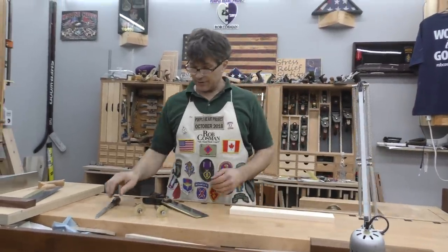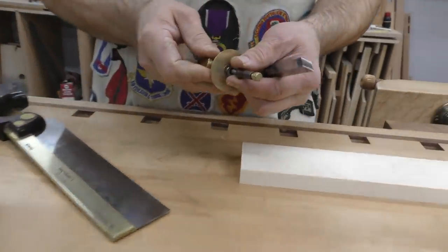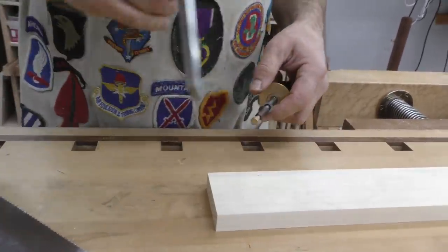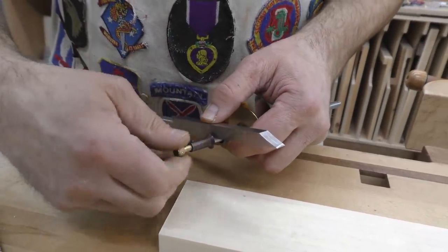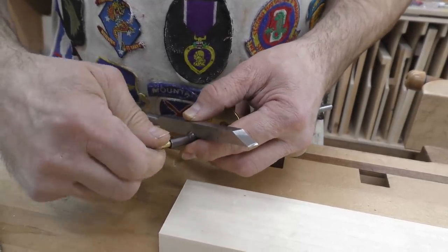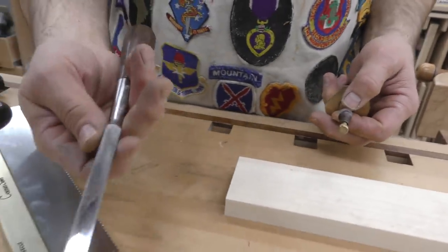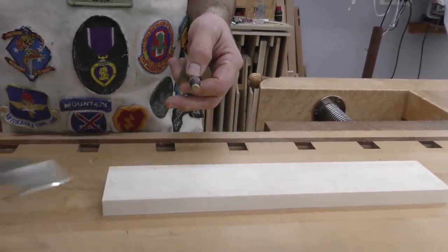First thing you need to do is know your measurement, and that always comes right off of your chisel. So you take your mortise chisel — this is called a mortise gauge. I actually designed this one; a friend of mine in Ontario helped me design and build it. I have two cutters, I put the mortise chisel between them and then screw that in until it is tight. This little brass knob locks it so it won't move. Now that dimension is exactly the width of my mortise chisel, and when I chop my mortise I do it with this chisel, so hopefully the walls of the mortise are going to remain parallel and it will be the exact width of the chisel.